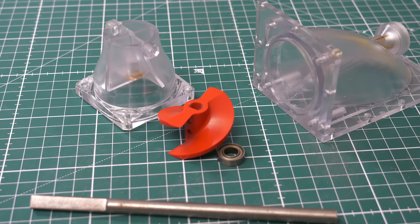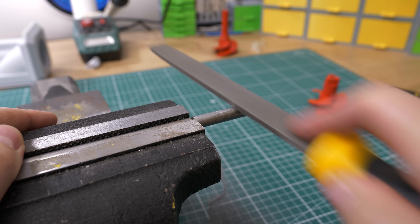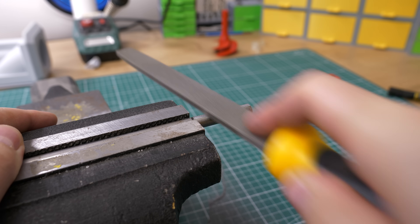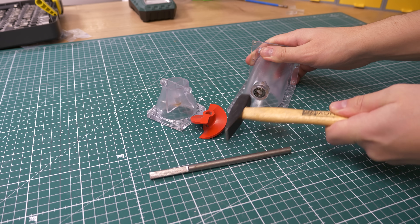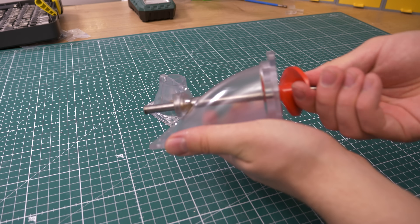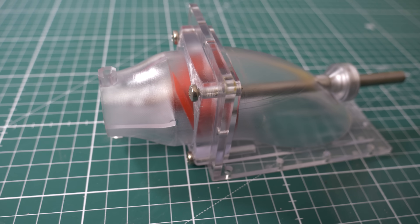I started with my own design because it makes a great example of how simple waterjets actually are. I took a 150mm shaft, sanded one side flat, and connected the impeller to it. Then I took one 8mm bearing, press-fitted it into the bearing place, pushed the shaft through it, and installed the lid with four M4 bolts. And it's done — as simple as that.